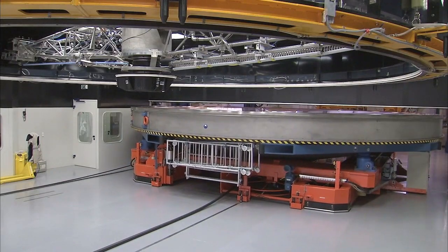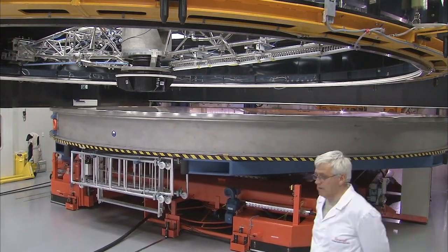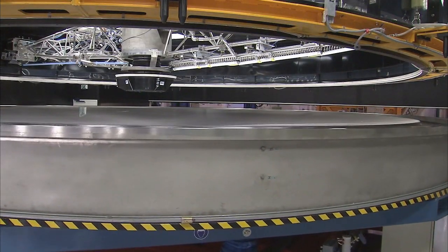The mirror is next taken into a clean room. The first action in the clean room is to treat any badly polluted areas on the mirror manually. This requires a steady and skillful hand in order to avoid scratching the surface. The point of doing this is to remove any particles that might not be easily flushed away during the subsequent washing. Afterwards, the vessel holding the mirror is positioned in the washing chamber, where the old reflective coating of the mirror is washed off.